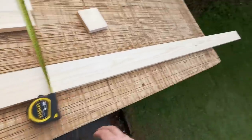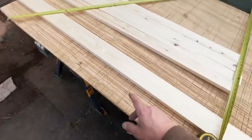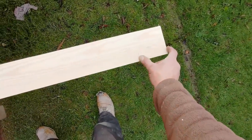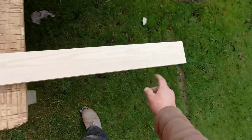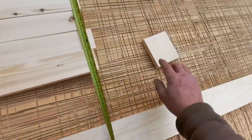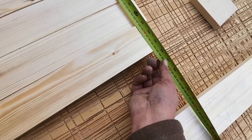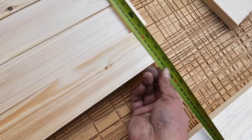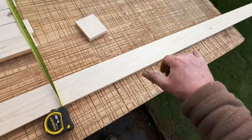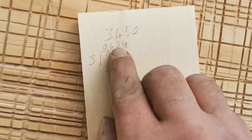I'm just working out the panelling. This is the top rail for the longest one going down that wall. I've cut 16 legs — they're going to be the uprights between the panels. From here I've got a four-inch on one end then three-inch in between. So from there to there I've got three, four, five — so I've got four legs, it's going to have five panels. That gives me 3170mm, so 3170 divided by five will give me my gaps in between — looks like 634mm.